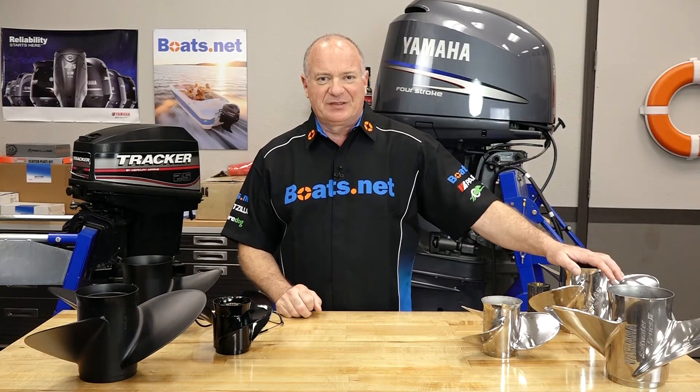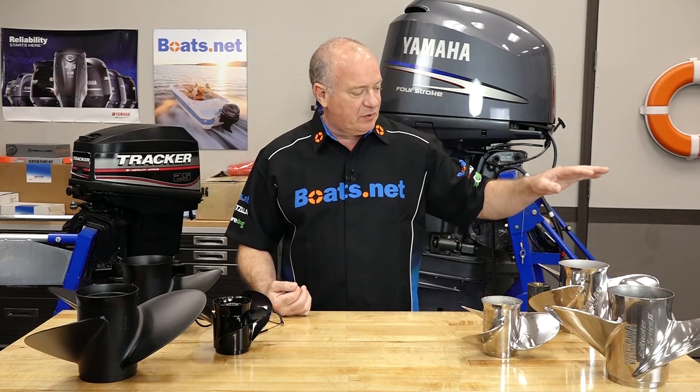So what is the final decision? Well, there really isn't one. It's all determined by how much you want to invest in a prop, how you're going to use your boat, what environment it's going to be in, and the performance level you're looking for. For most people, an aluminum prop will do just fine — you could actually have an extra one on board and still not approach the cost of a single stainless one. But if you've got a high-horsepower, high-performance boat, you're going to have to go with the stainless. The only other decision you'll have to make is whether you go with a pressed hub or a replacement insert for the hub.